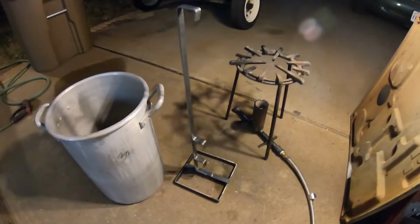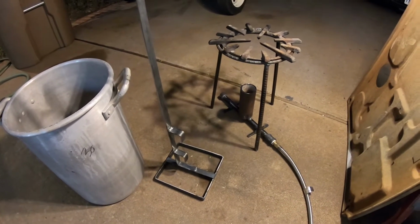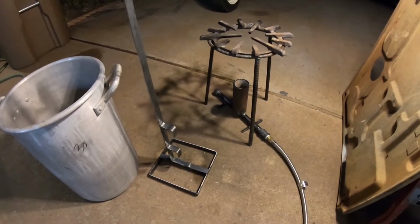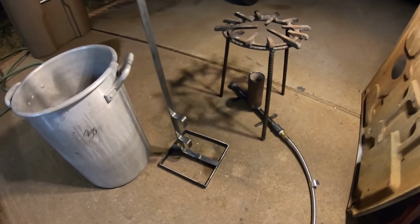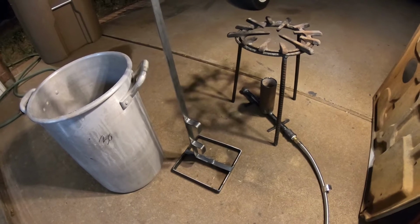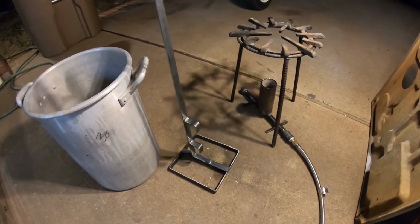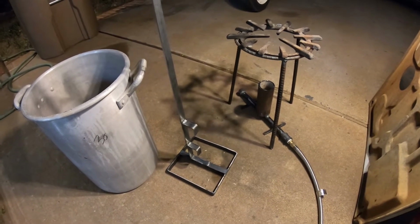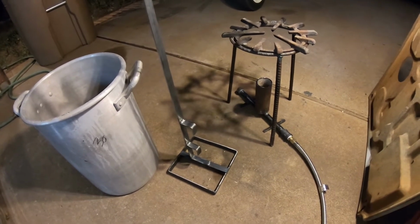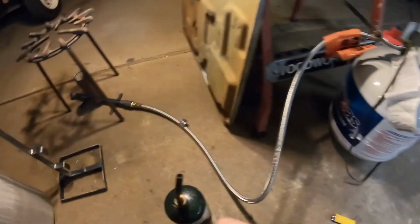Some of you have seen in the past, I crack shells. After speaking with some people on the internet, namely this one lady called Elizabeth, I believe she was at a university, she told me that their university has gone to 100% boil out when it comes to ridding the ceramic shells of the wax. And she also went on to say that they have nearly a 100% success rate. That is remarkable.